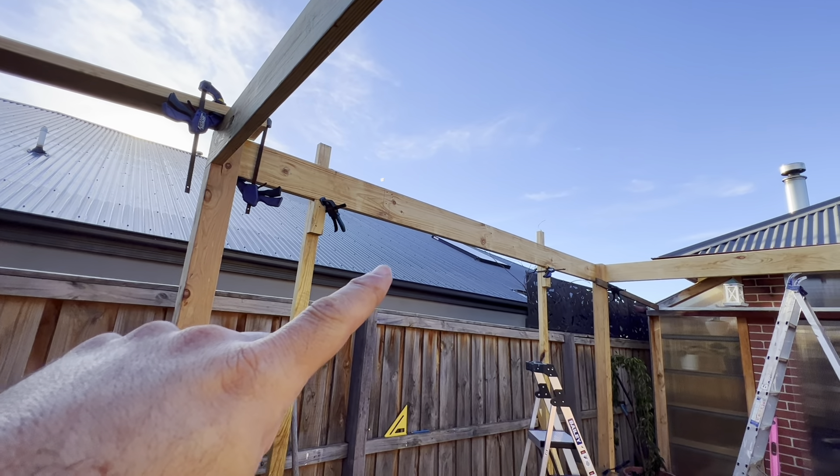This post was pretty straightforward — it just needed to be braced that way because it was naturally in the right position. Now we're going to pour some quick-set concrete — takes about 15 minutes — and we'll let that sit for the day and come back tonight.